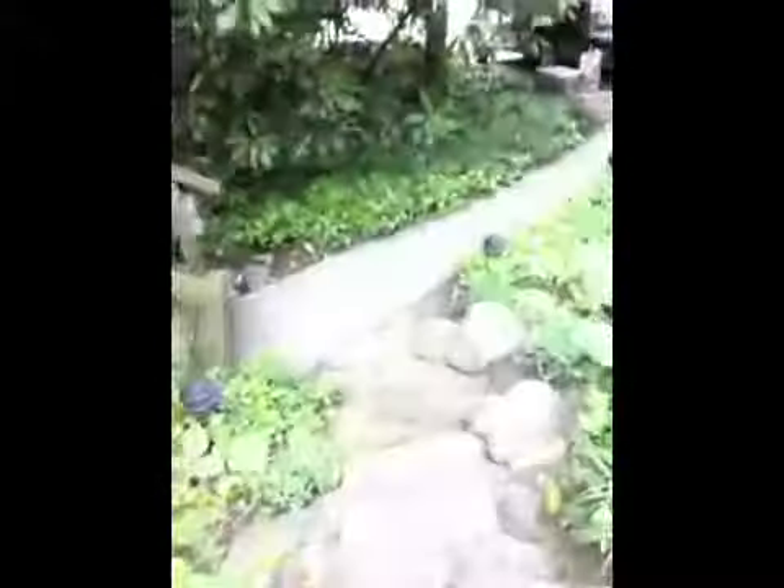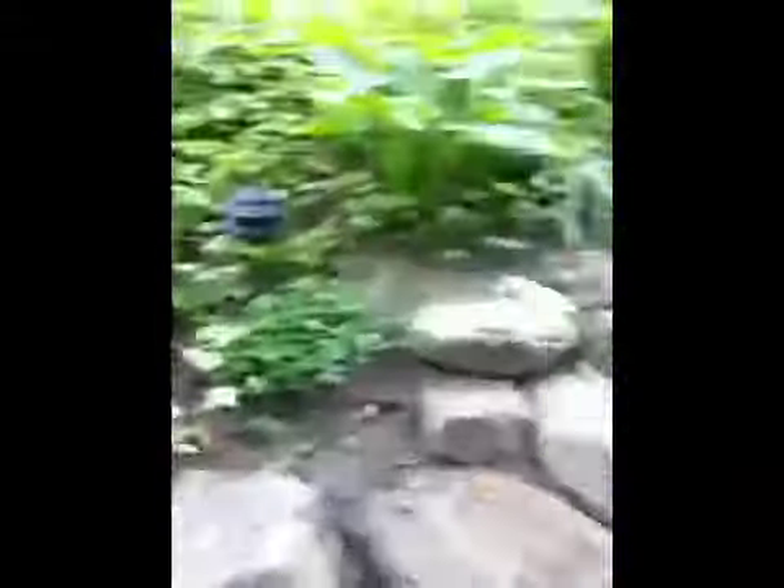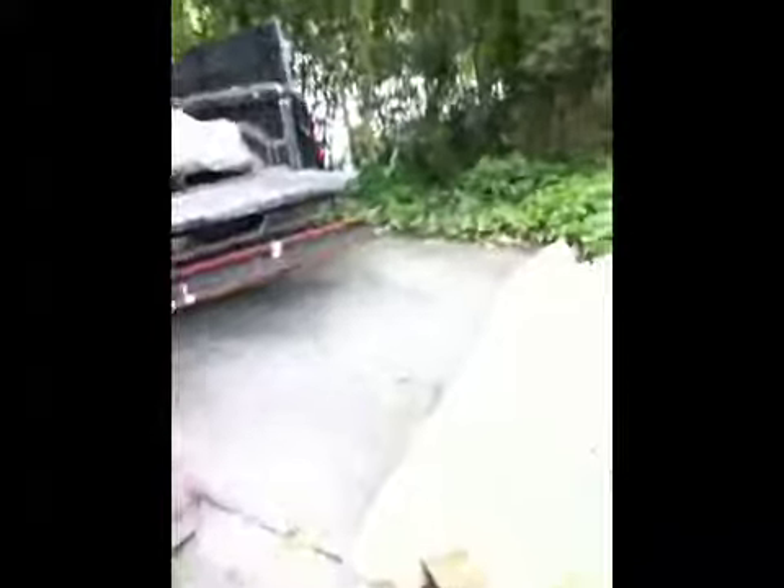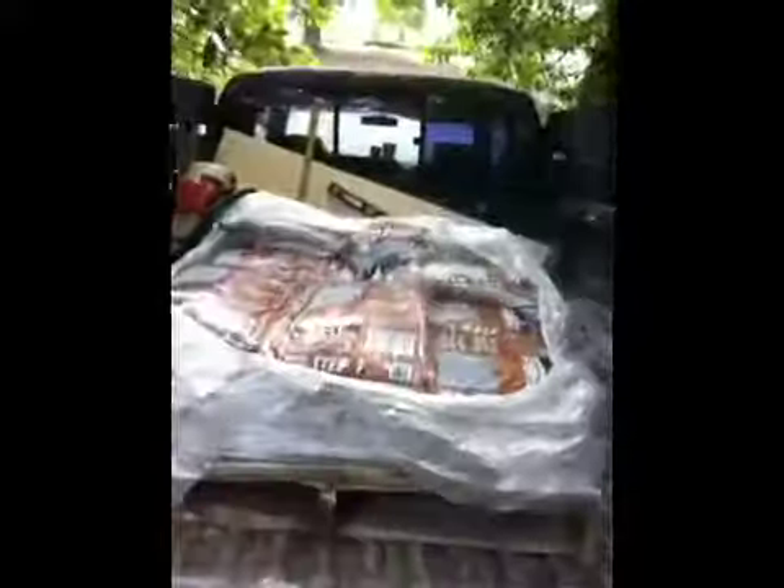Here's some other landscape projects we've done in the past with stone steps — that's crab orchard stone there. But these are our 6x6 material and these are our stepping stones. The color matches really well with the color of the colony pavers we've got. We'll be laying them in this paver base — this is just crushed granite, basically granite dust. Some people call it paver stone or paver base. That's going to be the base; we'll pack that real well. Got the materials here on the truck.